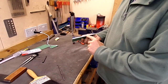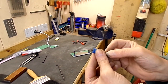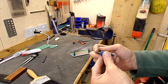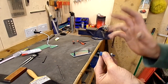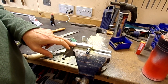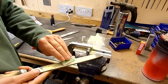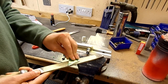The pieces are all nice and flush, gripped in position with the gripper pins. As you tighten this little knurled knob it pulls the whole thing together — that's the size of the hole. You push the thing down, it grips and holds everything in a line. Coming to the end of the rough filing — I've put a blue die on the side of the master for the file because we're getting close to the finish. I'm just using a scrap piece of aluminium to make sure we've got no nubs trapped in the file.